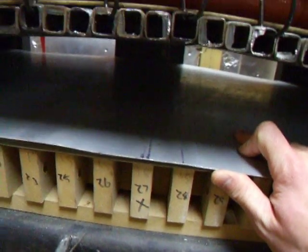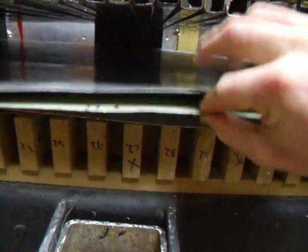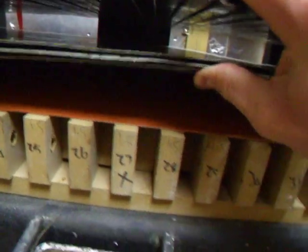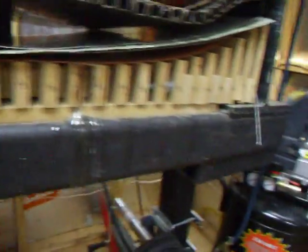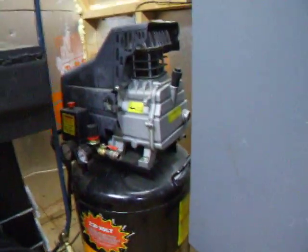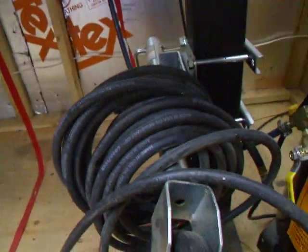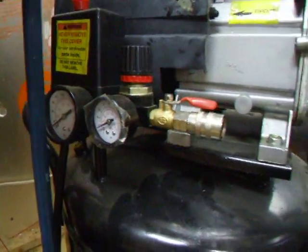I've been using them as flat cassettes: 2 pieces to sandwich the ski, and then 1 piece that sits permanently on top of the heat blanket for conducting abilities. Then you have said mold; build what you want. I can give you this one, I don't really care. The air compressor leads to the bladders, which have outlets out to the side. Pretty easy, you just use a black hose to attach, and then you can pretty accurately monitor the pressure here.